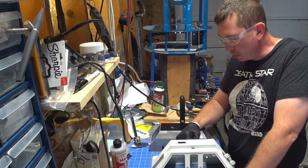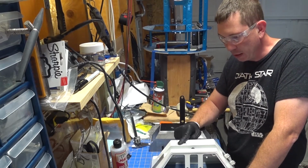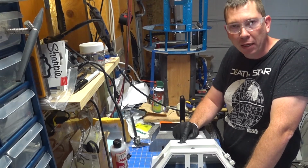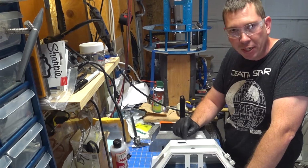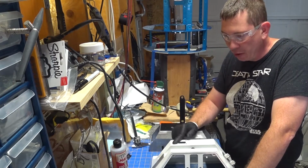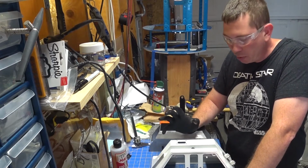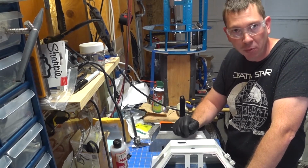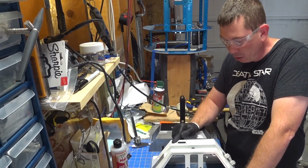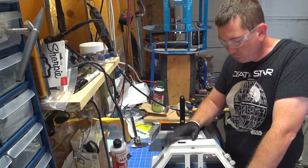I know most people's thoughts are, oh, what about this ugliness? I'm going to go pick up probably some galvanized steel sheeting, probably small sizes, fold it in half, and then just put it in here, and I'll put some JB Weld in there, level it smooth, and then I'll repaint it, reprime it, repaint that section just right here. And I'll mask everything so I only get the portions that I need. That will make it look relatively transparent, or not noticeable.